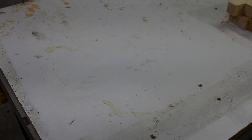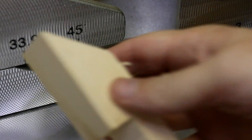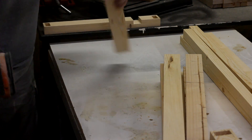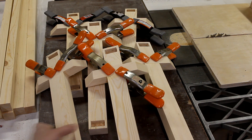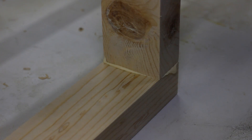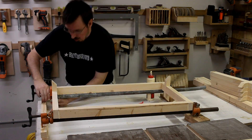With all of them cut, it was time to miter the edges of the short pieces. I gave all the pieces a 100-grit sanding to get them ready for glue-up, and then I started by first assembling all the cross-halving joints. Mortise and tenon, cross-halving, miter joints — you honestly don't need any of that. If you wanted to build this, you could do it just as well with regular old butt joints and screws. I just have a habit of making the simplest of projects overly complex. With the uprights dry, I could go ahead and glue up the mortise and tenons, then dropped it down into the pipe clamps, checked for square, and tightened things down for the night.